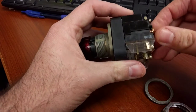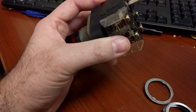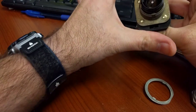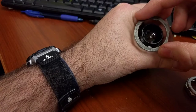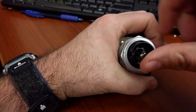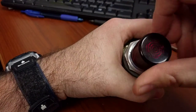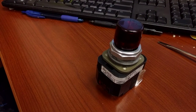I just put this together really fast — tighten down these two holding screws to make sure things come together. If I want to put this all back on my box, I would slide this through the back, then put the holding ring through here into place, then lock it down with the locking nut, making sure I have any washers to help make up the offset and space. Then at the very end, I would push on the push button. That is your standard illuminated push button — I hope that was helpful, and I hope you have a good day.